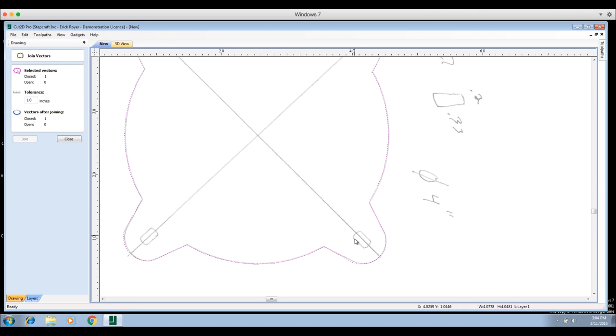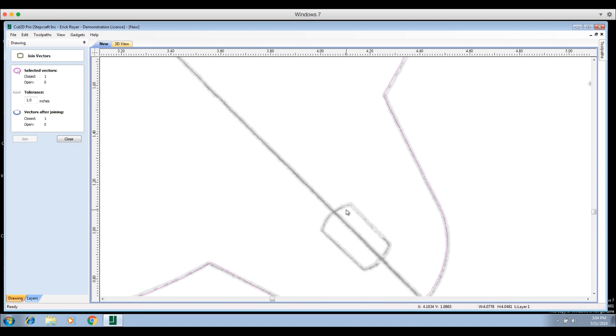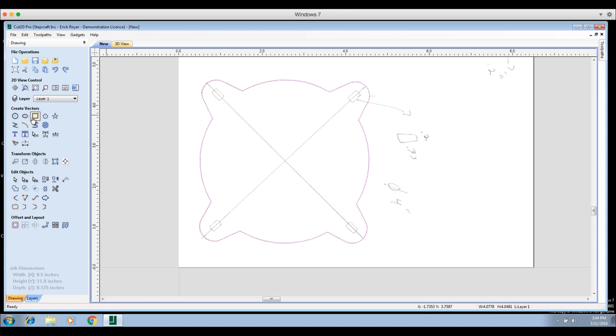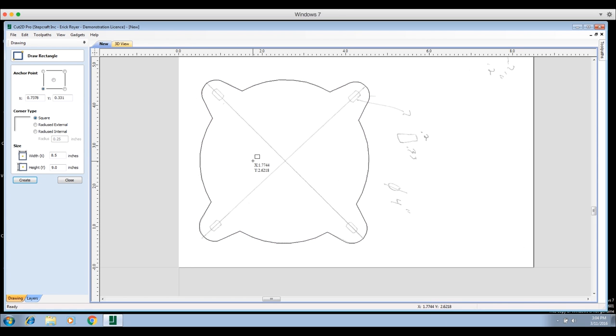The slots are a little different because they're elongated. We'll make one and modify it. The problem is that I drew inside the slot with the pen, so we can't use that shape as the accurate size. But we know from measurements that the slot is 0.2 inches wide by 0.33 inches long. I'll draw a rectangle anywhere on screen with width 0.2 and height 0.33, then click 'Create.'